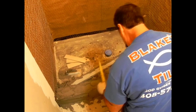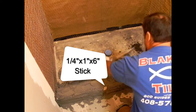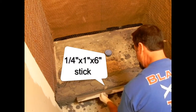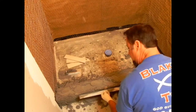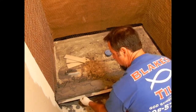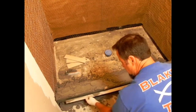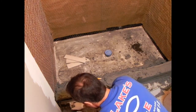Here now I'm measuring to make sure the curb is the same thickness — that's absolutely important. As you see I rodded off with my metal edge and plumbed up my quarter-inch by one-inch by six-inch sticks. When you put that chicken wire on there, make sure you just staple in the front of it. Do not staple on the top or inside the curb — that will get a leak going. So always staple outside, never on top or inside. That's important.